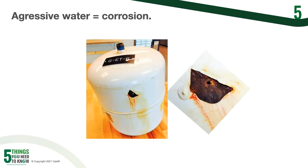Aggressive water can cause corrosion. Aggressive low pH fluids can accelerate corrosion in expansion tanks, such as improperly maintained glycol, which is often the main culprit. Solar thermal systems, for example, are going to see wide temperature swings from ambient temperatures to temperatures in excess of 300 degrees Fahrenheit during fluid stagnation conditions. These temperature swings can cause glycol to degrade and lose its important properties that protect the system from freezing and inhibit corrosion. Also remember that expansion tanks are typically the thinnest metal you're going to find in the system, so if you have any fluid quality issues, that expansion tank is going to be the first one to show it.